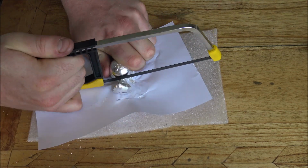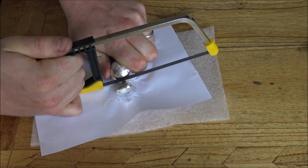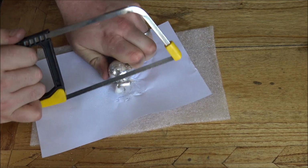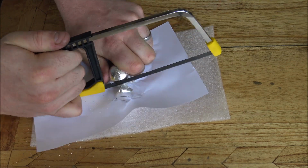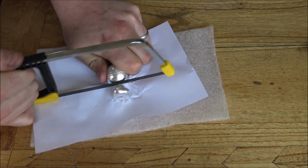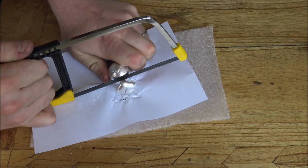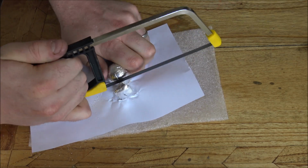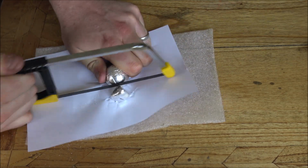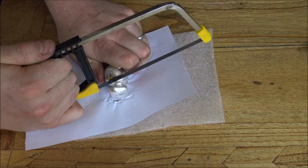These were the last ones I poured. So now we've just got to take the spur off and make sure that it's reached the minimum weight standard, because there have been a few that come out a little bit lower than the 5.4 ounces, which I am aiming for. So basically 168 grams as a minimum. And I think that's partly because when you pour the silver into the mould like that, there may well be very small air pockets within the actual silver as it cools, which is very interesting, the sort of physics of it.